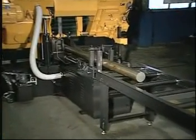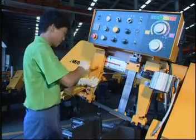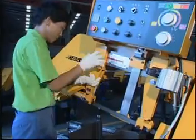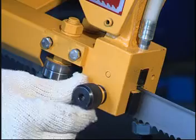The freestanding roller table is useful while you are cutting longer material. Adjust the guide arm carbide insert to always be positioned as close to the workpiece as possible to provide maximum support for the blade.